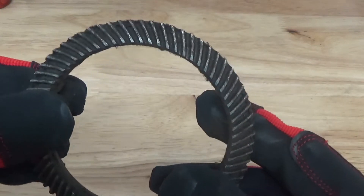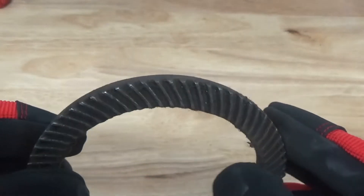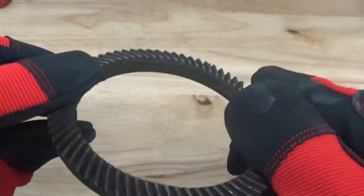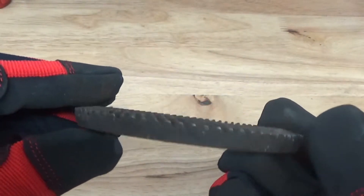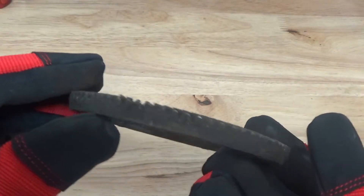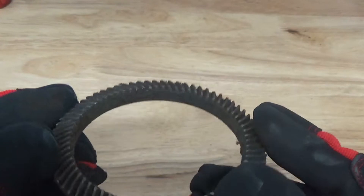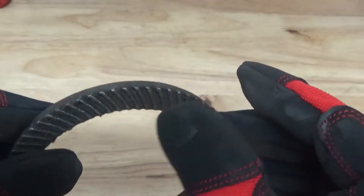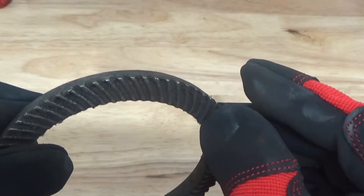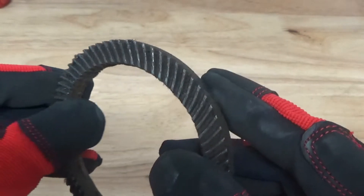Something new we will be doing aside from the general cleaning is working with a very fine mesh media in the 5 micron range. We are going to be doing a wet shot peen at 150 psi, and at the same time we're going to be creating micro divots on the surface — again, 5 microns.